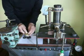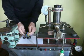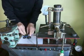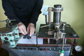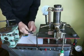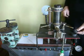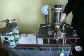There are many advantages of this system over traditional methods, and these include the ability to easily, safely, and economically cast and recast, waste-free and without using any toxins, the same metal in just minutes as needed, using inexpensive, reusable graphite molds into a variety of findings and components. These include casting grain, rolling gold for sheets, or bars, cones, discs, wires, shanks, or rings, and bezels and prong settings for solitaires.